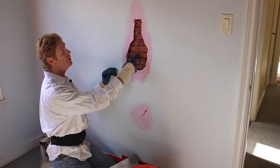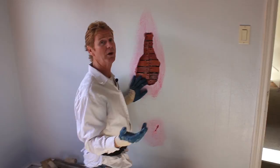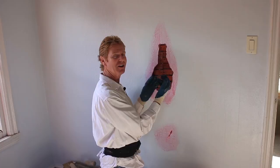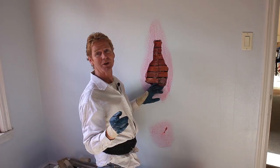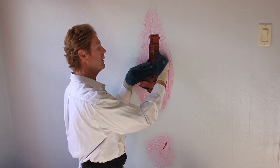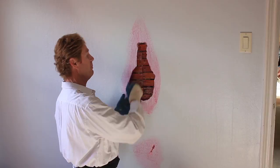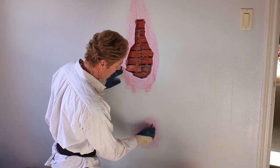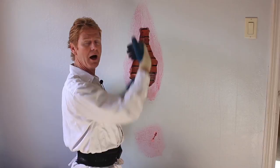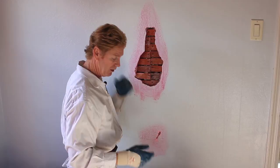Now what we had here was just like a little mountain. The fellow said, well, how much should we take out, and do we even need to, or can we just skim it? What we had here was it was bubbled out a little bit. I said you guys pounded on the wall on the opposite side. Yeah, we did, because we had a vanity mirror and we had to push it. What you did was you made a little piece of plaster loose and that plaster fell behind and bubbled this out — so there was a little mountain. The only way to get rid of that is live with it or tear it out with a razor knife, which takes about a half hour. That's what he did. The wall is pretty solid other than that, but when you pound on the opposite wall it causes vibration, which can cause cracking, and sometimes that loose plaster will go behind the wood or on top of the wood and bulge it out a little bit. I'll show you how we fix that quickly.